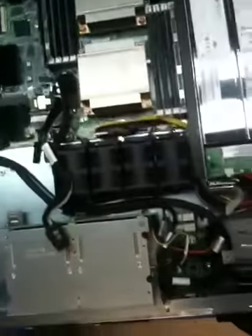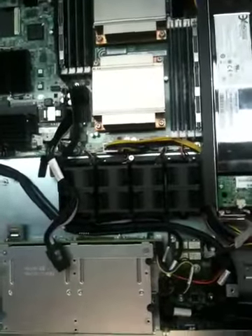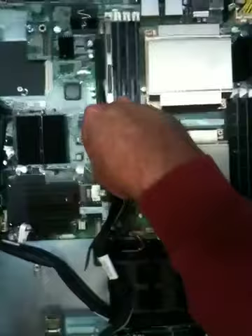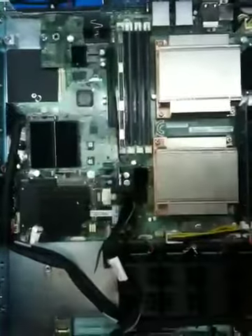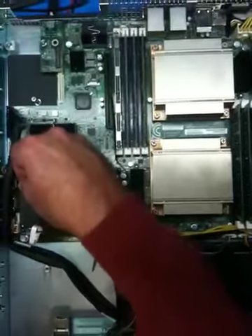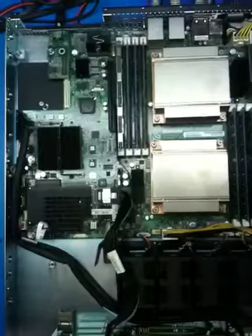Also in the kit associated with the standoffs are four pins to secure them. The pin looks like that. Each one of these standoffs has one of these pins pushed down through it to spread the standoff retention features out, holding the module securely to the board. Note that one can become tricky because it's right next to the heat sink.